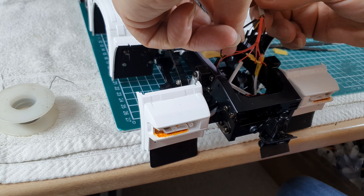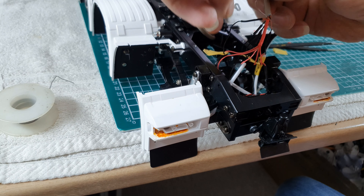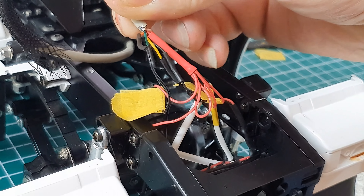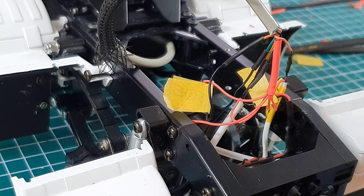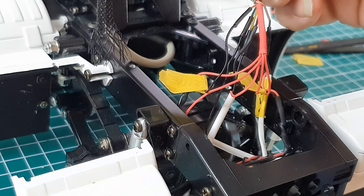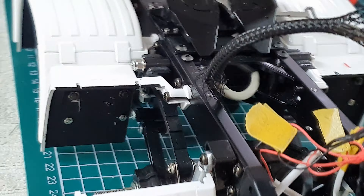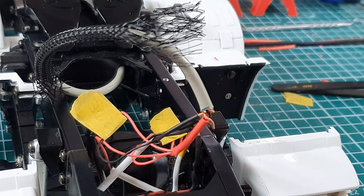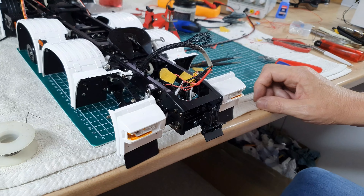All the soldering is done — I've put a bit of braid over the back end of the cable. All the connections are heat-shrinked down there. I'm just going to put a little bit of tape around that frayed end — that's just to go over the top of the axle casing to give the cable a bit of extra protection.